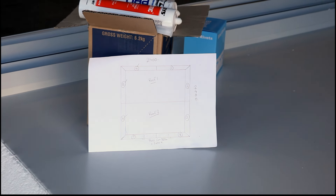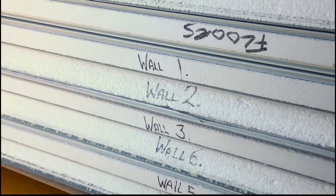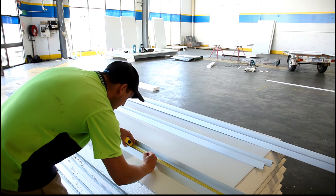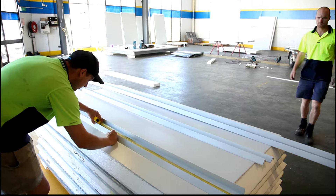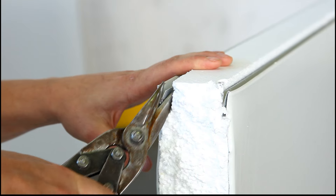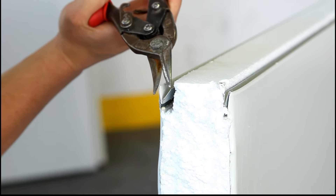The kit includes all walls, floor and roof, door, rivets and sealers. Mark angle lengths — longer for exterior, shorter for interior — at intervals of approximately 300mm for drilling and riveting. Now snip ends of connecting halves of floor for easy assembly.